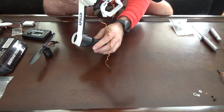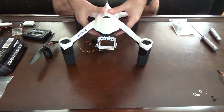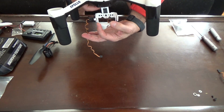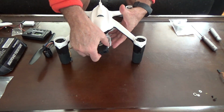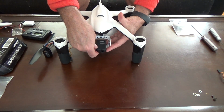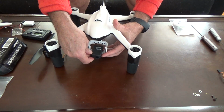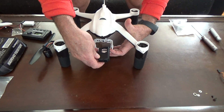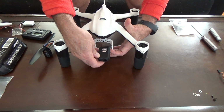The gimbal includes 2 servos. This gimbal was modified. I did make it a little bit narrower because I wanted less weight. I was going to put a Mobius camera on it, and it would accommodate like this. You would have to put it towards the front so you clear the wires. You can put a camera up to 45, 46 millimeters across.